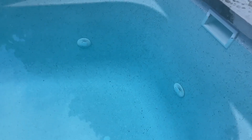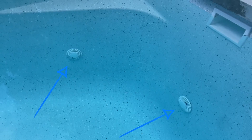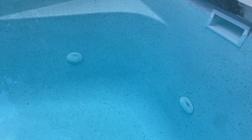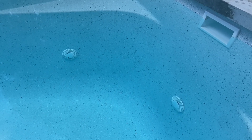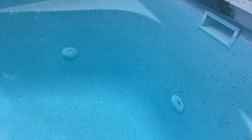G'day DIY pool legends. Today we're going to be talking about plumbing a pool when you've got separate fittings for your heating system. This is the deep end pool wall and you can see the two safety suctions sitting there. The reason why they're called safety suctions is if a little person gets stuck onto one of the fittings, all the suction pressure shifts to the other and the little person can swim to safety.